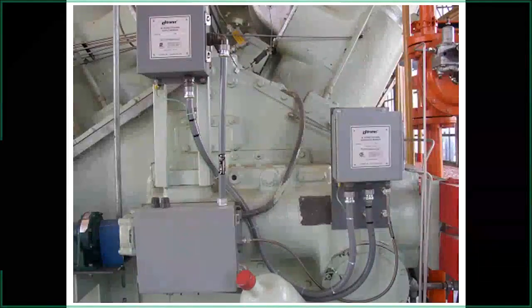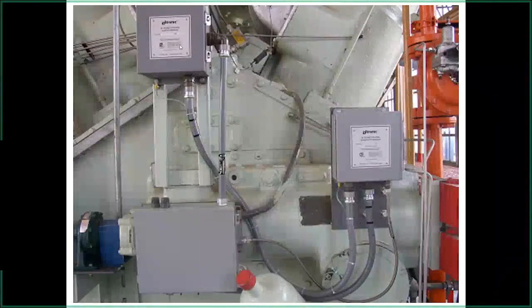Here's a layout on an engine — the 16-output module is at the top with one cable coming out, and the diagnostic module is alongside it. The nice setup here is that if the diagnostic had a problem, you could disconnect its cable and run directly to the output module to get the engine back up and running. Try to keep the modules close to each other so that in case of a problem — like a lightning hit — you can easily jump a cable across, turn that part of the program off in the logic module, and continue operating the engine.